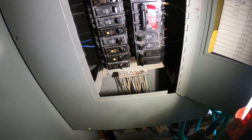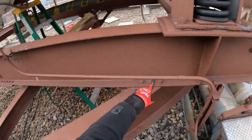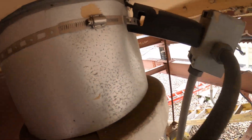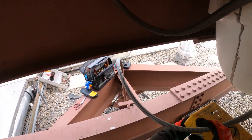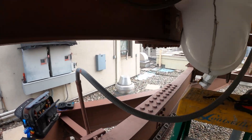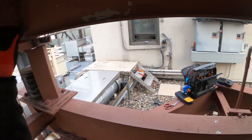Easy money. The only thing that is connected here are these two wires inside this conduit. Before, it was just that one heat trace connected and everything was fine, so we know we're good there — it stayed on all night. That's confirmed, there's no issue there. The issue is somewhere between this line, this heat trace, and the next heat trace.